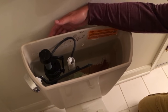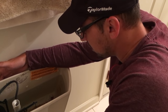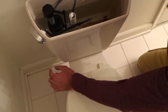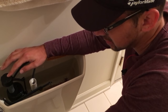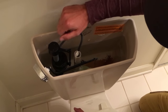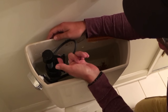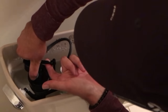How do we know what needs to be changed or fixed? First thing we did is we turned off the water. What we're going to do — no matter what, even if it isn't the problem — is clean the diaphragm. To take this off, it's kind of like a pill bottle: you're going to push down and turn counterclockwise, while lifting this arm up.